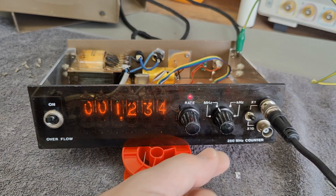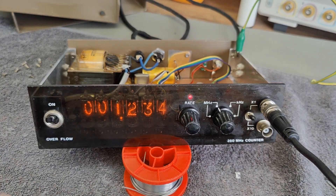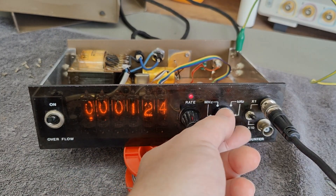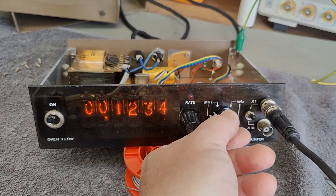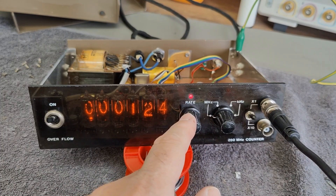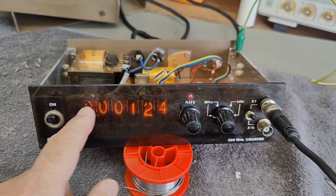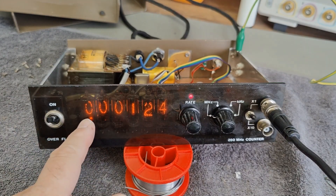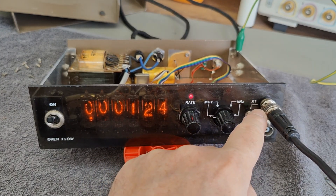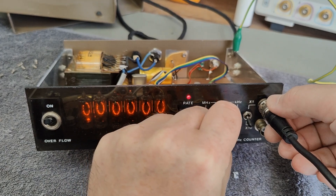It's quite fast in this mode. My input here is 1-2-3-4 hertz. So let's give it over here — now it moved. I'm removing one digit, and now it goes 10 times per second, so it's much faster. The readout is of course one megahertz here — this is 9.9 megahertz — and there's a nice little dot. This is the times-one input, so there's a prescaler. When I go to times 10 — well, you need to figure this out yourself. So I'll move the input to times 10 and then we'll see — it will of course take 10 seconds.